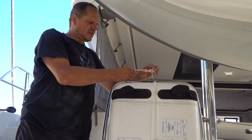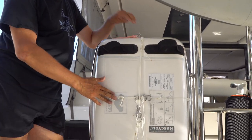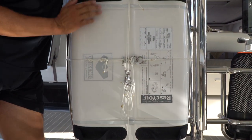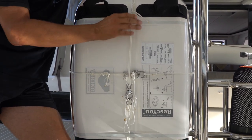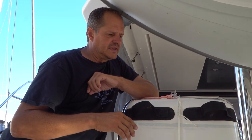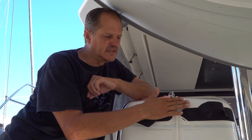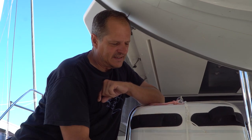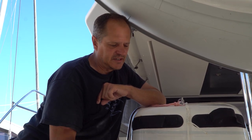We've got a painter line on top connected to the boat, so if the life raft drops off we just pull the painter line and the life raft will deploy. I think this is a much better option — I've got two lines protecting and keeping it there, otherwise it could just fall off if accidentally triggered. I was thinking of a hydrostatic release as well, but at the back here it gets quite wet when going downwind fast, and that hydrostatic release might release accidentally and we'd lose our life raft. Once deployed, it's like a genie that comes out of the bottle and can't be put back.